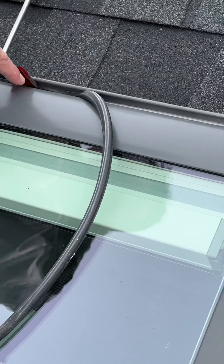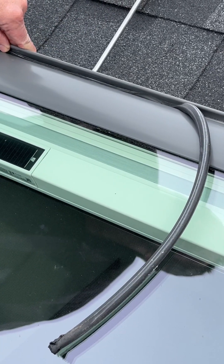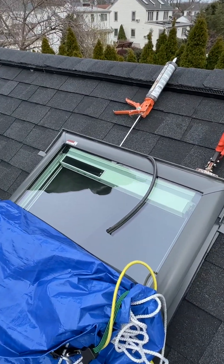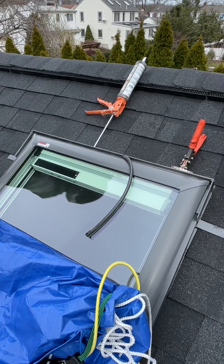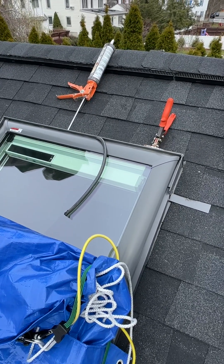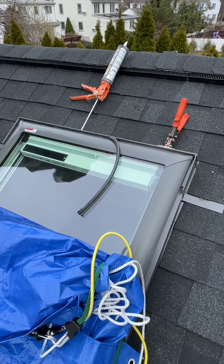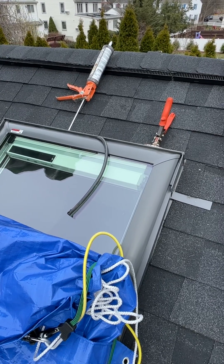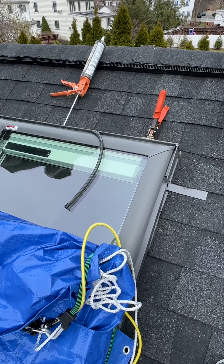The way you had it before, the flashing was over the gasket. It's supposed to be pressure between the head flashing. I'm old, I mean 30 years — that's not right. They'll train you and give you answers to tell us, but that's not right. They're going to tell someone with 30 years experience they've been doing it wrong? We haven't had one leaky skylight in 27 years.